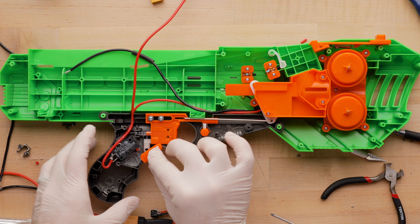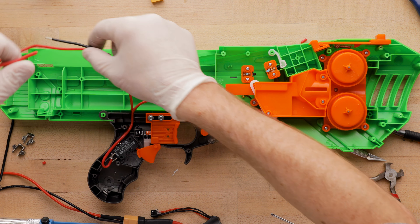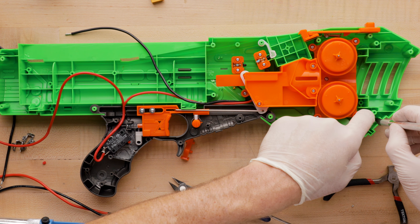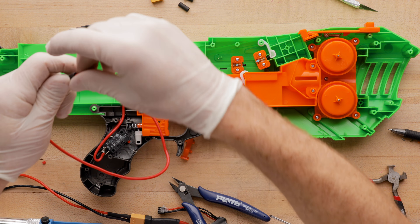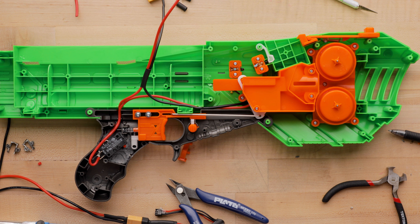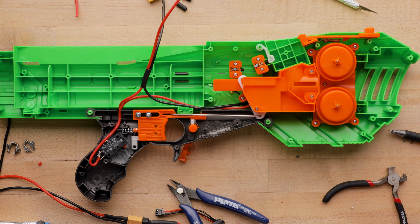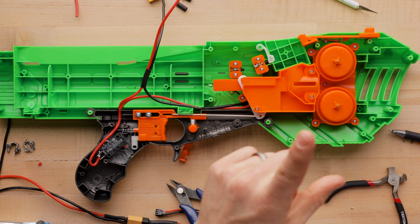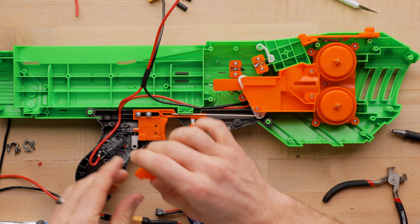I'm being gentle here because I know that switch is not fully set in place. I also do like to come back and check — does my switch still work? Yeah, we're good. Now we have no safety. I did keep this white sliding piece because it adds a little additional pressure to the switch — it might not be necessary, you could probably lose it altogether. If you like a heavier trigger pull, that's giving you a little bit depending on how much action you allowed for the switch.